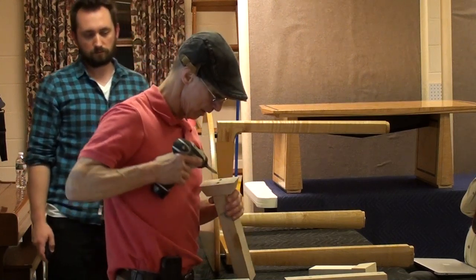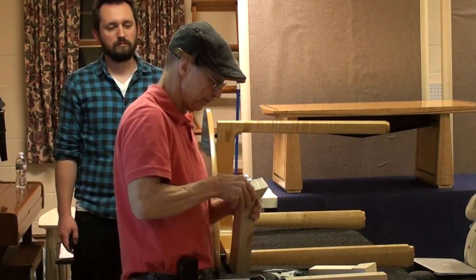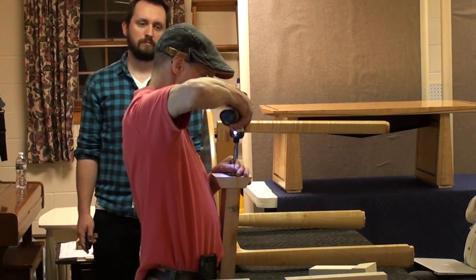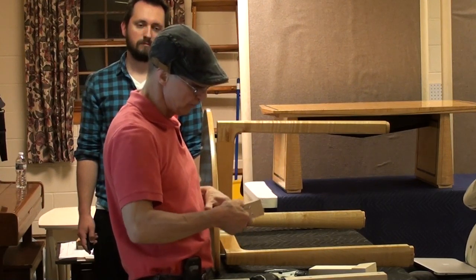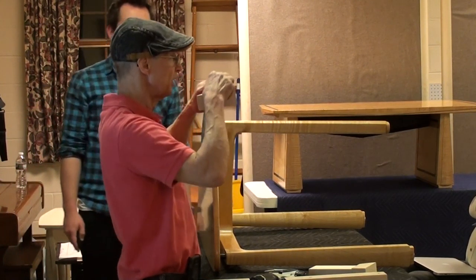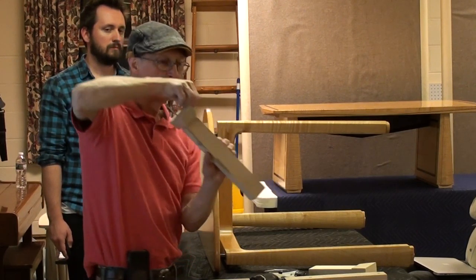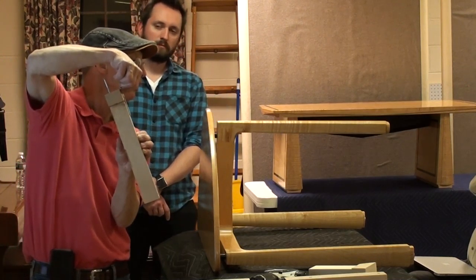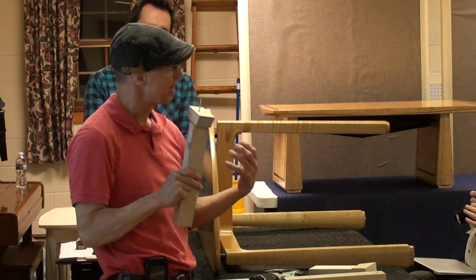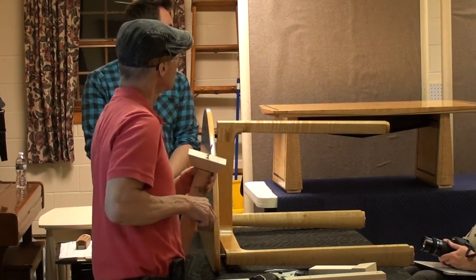For the people who don't have a domino — and I should say why we have that — because if you drill into end grain and put a screw in end grain, it doesn't have much power. It's not the best; you'd have to go with a pretty long screw. But if you put that screw through the side grain of the dowel, it really locks it in. If you had something like a workbench and really need a lot of strength, you can put a steel pin in there and drill and tap it. It's almost like bed frames where they have the bolt that goes in.